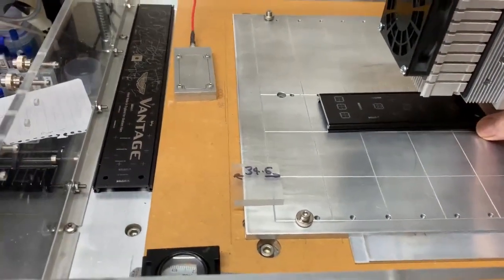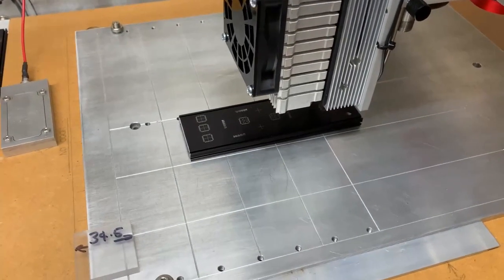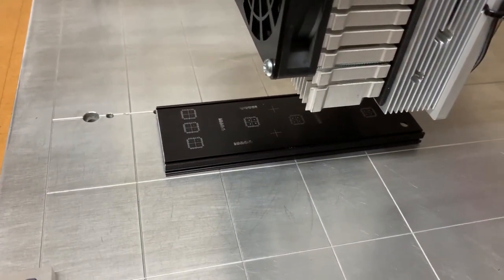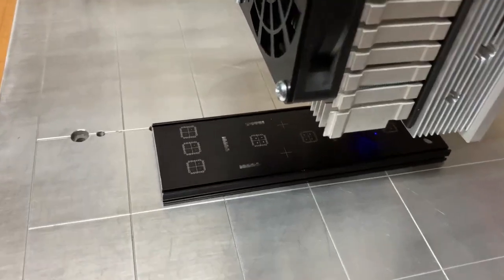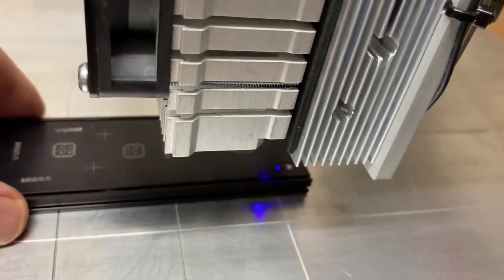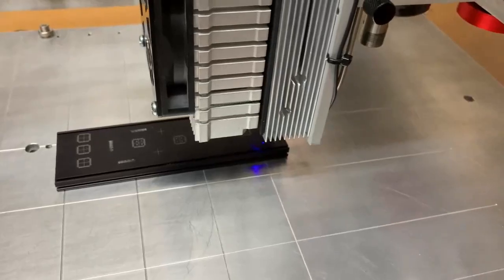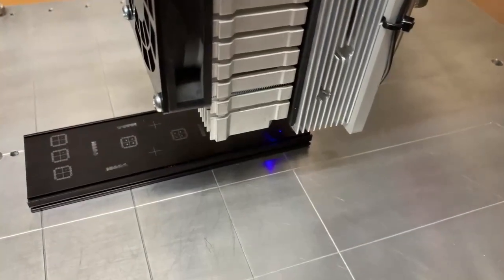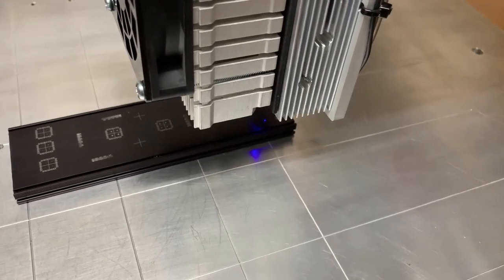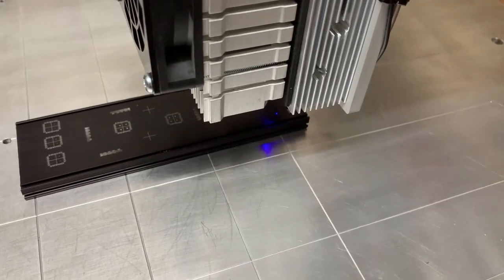The other quick test I quite often do is I want to just have a single spot. The way I do that is I've got my PWM set to 3%. I'm going to turn my laser on. You can see I've got the spot there to position it. Let's say I want to just do a single spot just here. So then I will turn the laser power very briefly to 100% using the bypass switch. Currently it's on focus mode at 3% power.